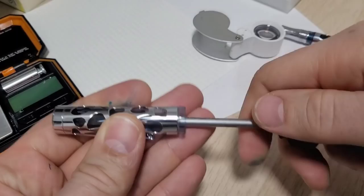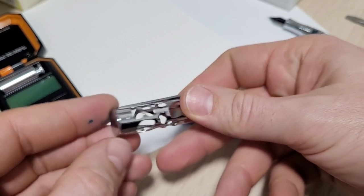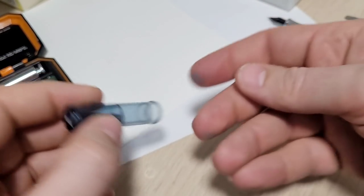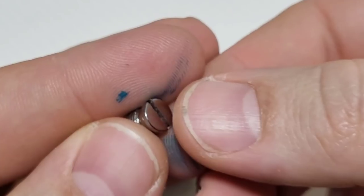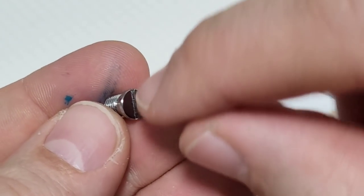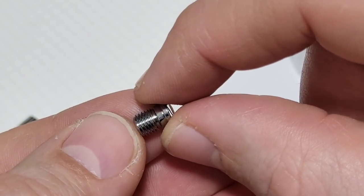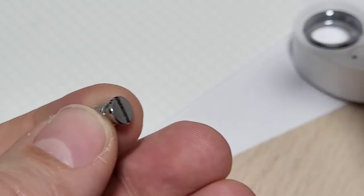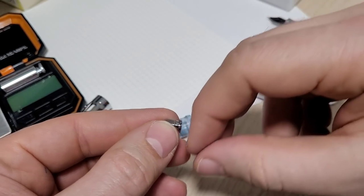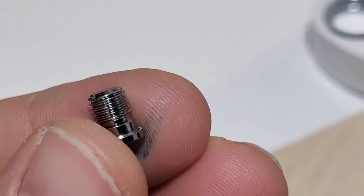With these types of coatings, when you have that touch in the body, you can already see a little scratch there — just a bit of a design choice. There's a screw at the bottom of the cap — I wouldn't have done that screw that way. The clip is down in there, pressed on. One thing: it is captive, it has an O-ring, which is nice. But this screw looks like a standard off-the-shelf plated screw. You should just go straight stainless steel, because eventually the plating could fail.